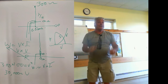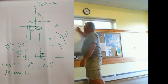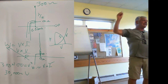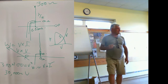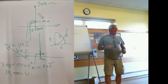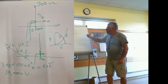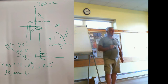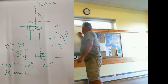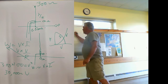No, you don't. Infinity. What do you have? Thousands of ohms. This theory, roughly 300. Oh, okay. That is the radiation resistance of the monopole, 300 ohms. This is great, great news. Why is it great news? Because if you've got 0 there and 300 there, what do you know about somewhere up there? You know a point somewhere up there is 50 ohms. So now, if you like, you can connect your piece of coax cable to this point.